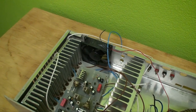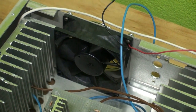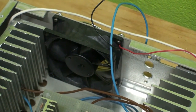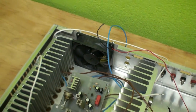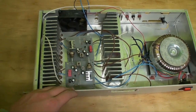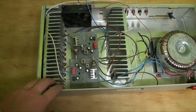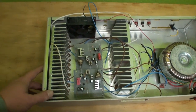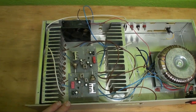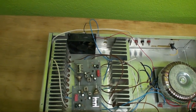This right there is a bit of an imperfection — it is a ventilator fan. I really don't want to have that in any audio equipment, but this thing being a Class A amplifier, it is going to run very, very hot, and the top cover doesn't have a whole lot of vents in it. Since I don't want any heat building up causing hot spots and things to break, I'm going to build in a ventilator fan to keep the air moving. It is a 12-volt fan and I am going to run it on 6 volts, so hopefully it won't be all that noisy.